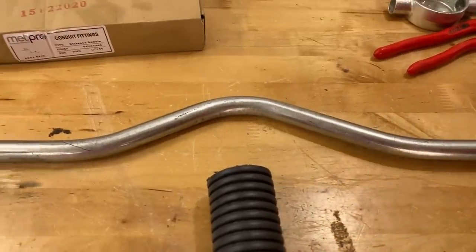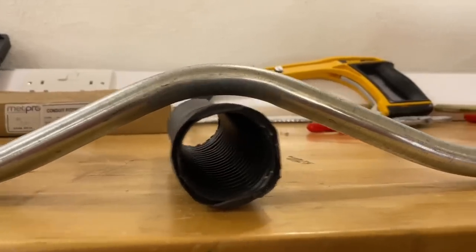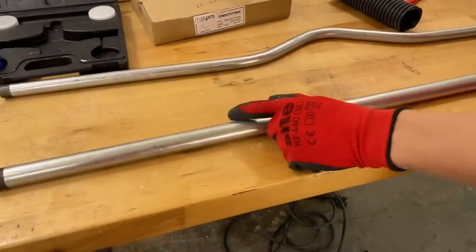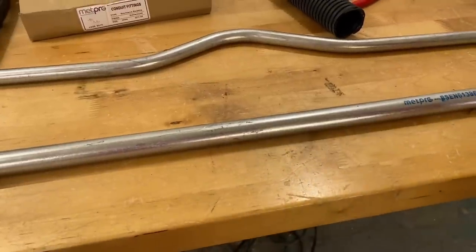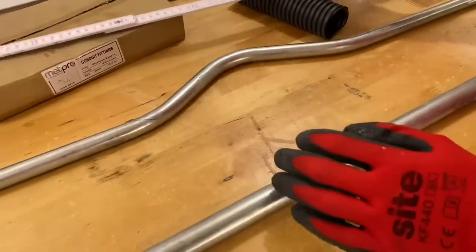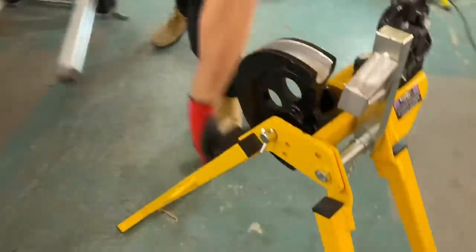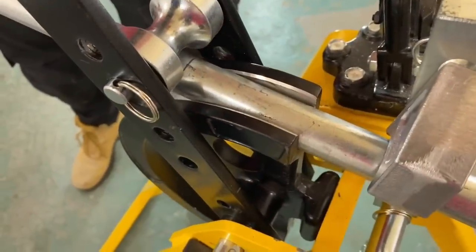That's the obstacle we're going over — a 50mm diameter flexible conduit that I've bridged over, and you're going to have to do the same. So Jake brings his piece in and marks approximately the center. We're going to do exactly the same as what's up here — the piece is about a meter long. That first bend is at the middle, the starting point, so we'll mark that at 50mm. We've set the conduit bending machine up with the correct size former.